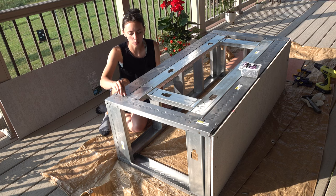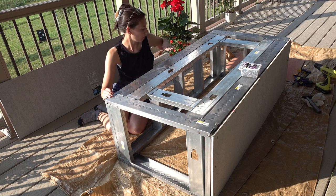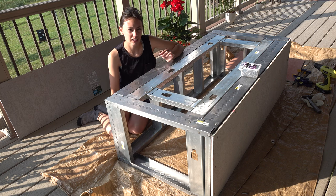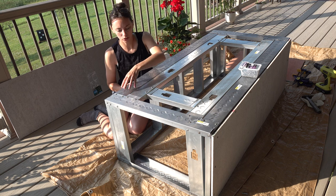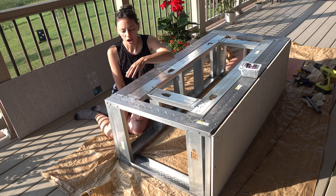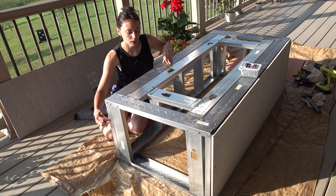When I made the dimensions of the metal pieces, I took away 2 inches, so our overall cut length is 58 by 28 roughly, give or take, and that accounts for the thickness of the Wonder Board that we're going to be putting on here to attach the thinset to. Most of the horizontal pieces are just the metal rail that you can get right at Home Depot — I'll include a link in the description below — and the vertical pieces are metal 2x4s.